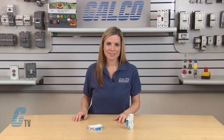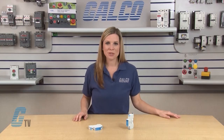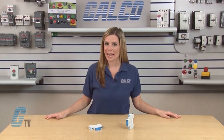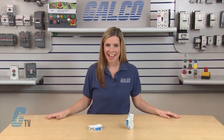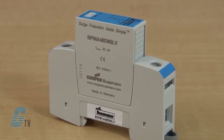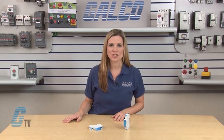The low voltage models are available in single pole type 2 and 2-pole type 3 SPDs. The type 2 SPDs have a wide range of models for systems from 48 to 600 volts AC and 60 to 600 volts DC. They utilize metal oxide varistor technology for surge protection. The type 3 SPDs provide low voltage control for 24 volt AC-DC to 230 volt AC-DC systems.